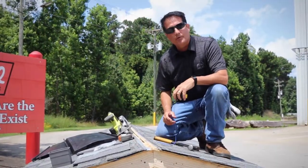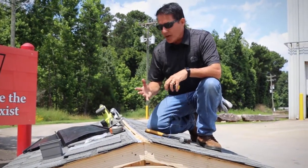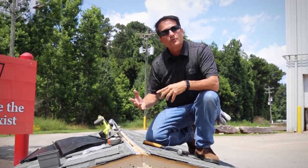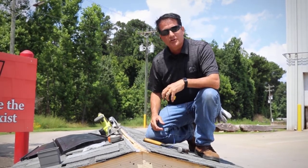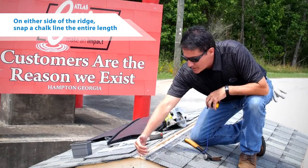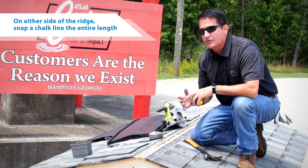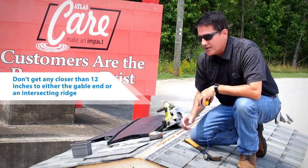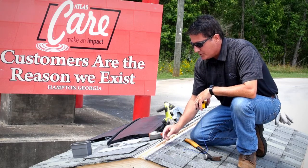The process is pretty simple. The first thing you want to do when you do any ventilation project is to properly calculate your ventilation needs — either the 1-300 or the 1-150 ratio, depending on your attic size and installation methods. Before you start cutting your slot, give yourself some proper distance before your gable end or any intersecting ridge — about a foot, about 12 inches. You want to take one inch off of each side of your ridge and cut that slot.